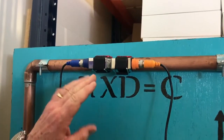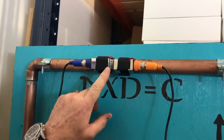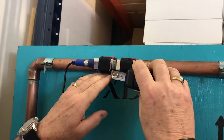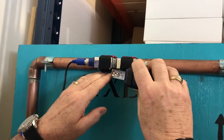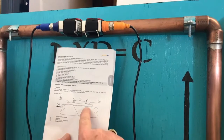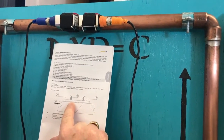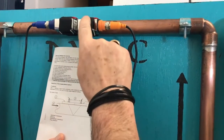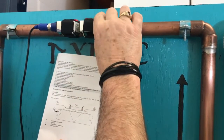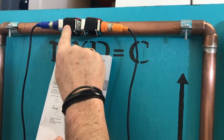The meter tells us that we need to space the sensors 0.4375. We have a measuring ruler, so that's less than ½ an inch. So there we are, 0.4375. We're using the V method according to our pipe size. 3/4 inch to 4 inch pipe, use this method. The V method shoots a signal from our upflow down through the pipe, through our liquid to the bottom of the pipe, and back up to our outflow sensor.